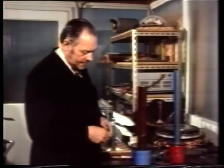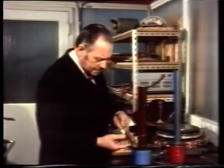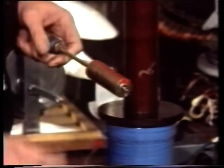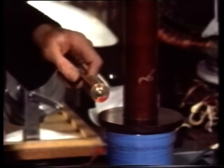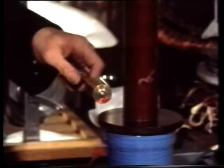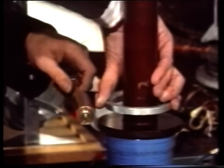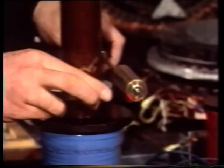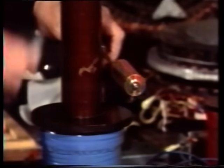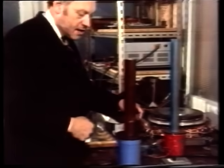Now what is the secret of this amazing device? This is the giveaway — this is a copper cylinder that is free to spin. If I hold the copper cylinder alongside, there's nothing much going on. But if I take this ring which wants to float up there and I force it down alongside the copper, then the copper begins to spin — and if I put it on the other side, it spins the other way. It is as if there were an upward sweeping something causing the copper to spin, and we call that upward sweeping something a traveling magnetic field.